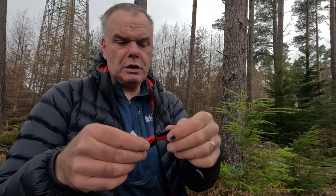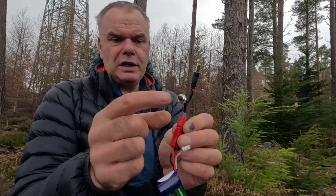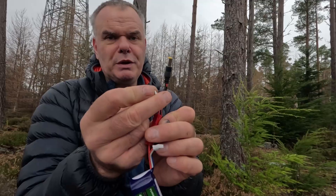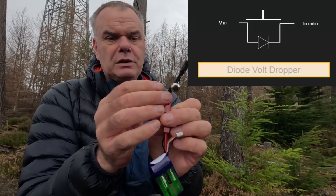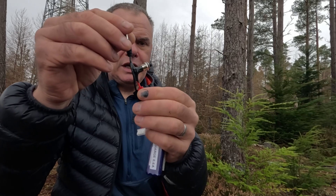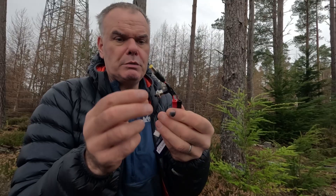What we do is plug in my voltage dropper, which is simply a push-to-make latching switch and a diode across the switch terminals. The whole lot has been sealed up in waterproof liquid PVC tape, which is absolutely superb — bomb proof.